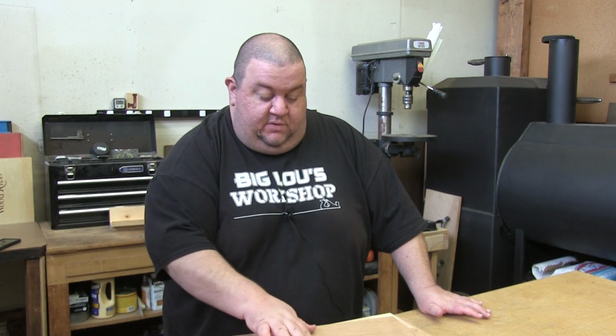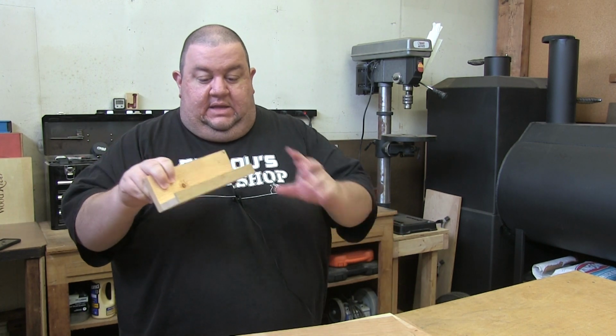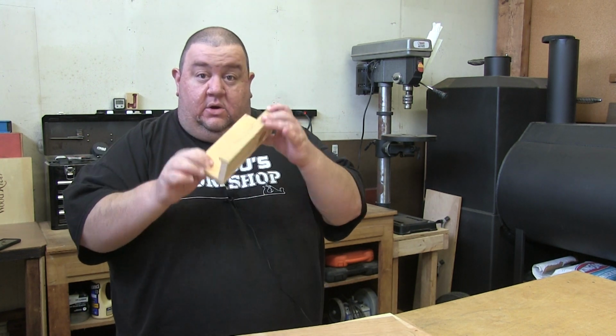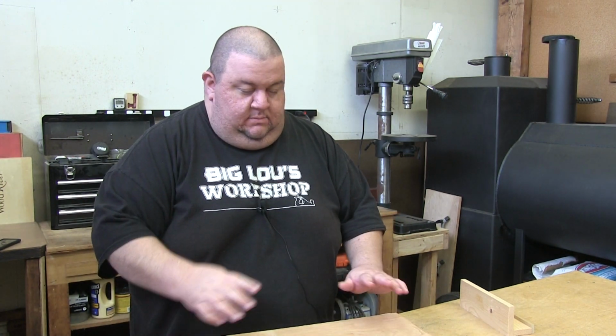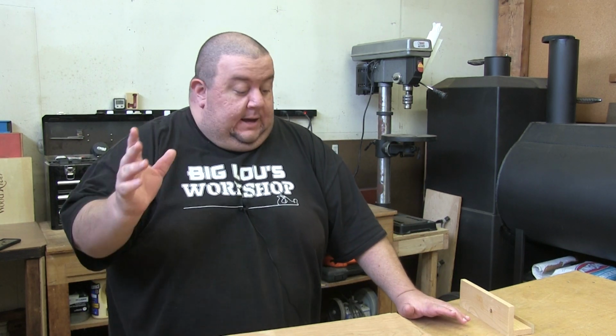on it, these are incredibly smooth, but they're still not finished smooth. There's still a couple of lines on here, and seeing as how the angles that I have on these mock-ups that I did are going to be really hard to get in there with a sander after I put them together, I'm going to go ahead and sand these to their final sanding grit, however you want to say it. Anyway, I'm going to sand them before I cut them up.